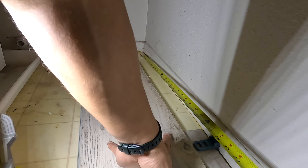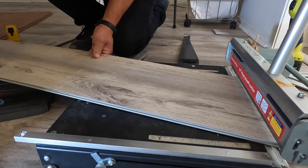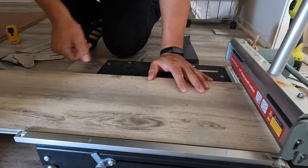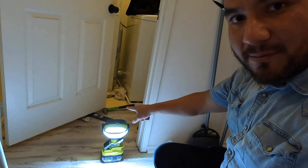So this cut is going to be about 25 and 3/4 inches. I made my marking for 25 and 3/4 which is here. I'm going to continue the work, installing the vinyl plank flooring in the laundry room. I've already got somewhat of a head start — there are already some planks laid in. I have a piece cut at 25 and a half inches that I'm going to lay right now, and hopefully I can shift the washing machine enough to work on the other side.